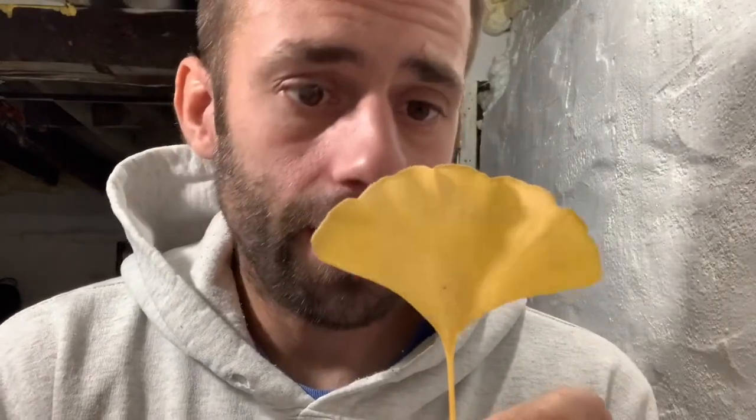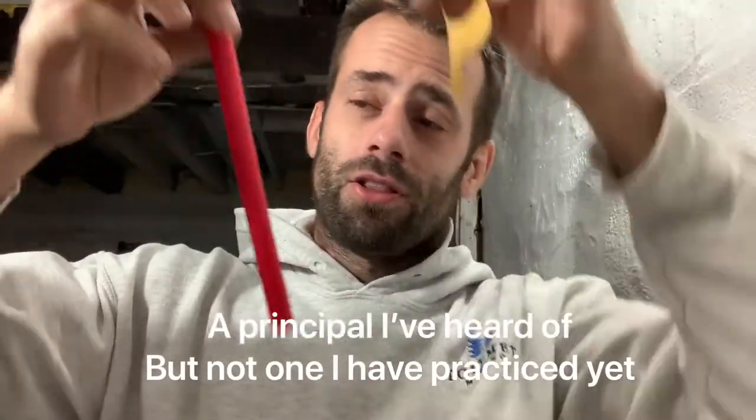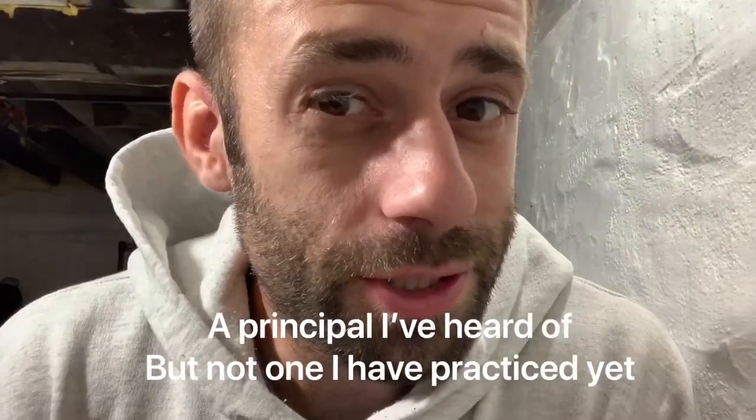Now for the leaves — it's very thin, so it'll be a little difficult to get all the metal in there. This is when you need a vacuum caster or centrifugal caster. I made a vacuum caster but it didn't last too long and I haven't made another one yet. So I'm going to try a different concept: when you have a long enough sprue, that generates pressure. So instead of sucking the metal into it, you can pressurize it by having a long enough sprue. That's what I'm going to try.